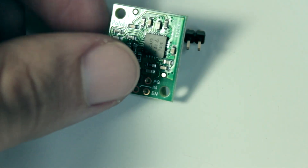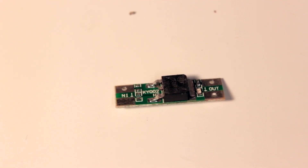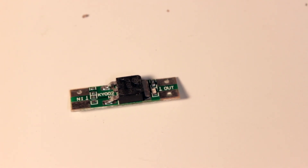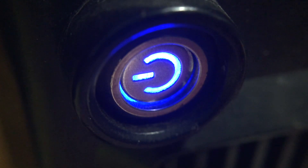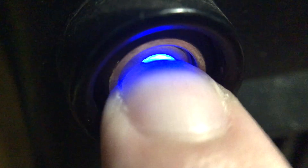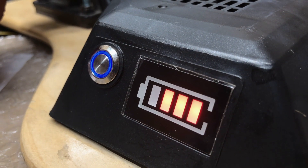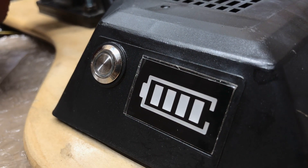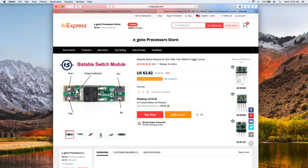The problem is I needed a way to turn it off and on at the same time as the battery indicator, which brings me to my third component: a generic soft latching power switch. Power switches come in several different types. My Firefly uses a slide switch — pushed one way on, the other off. Another type is like the power button on my Echo: you push it down and it latches to turn on, press it again and it pops up to turn off. That's a latching power button. However, I was looking for something like what's on my Meepo V1 — a single push button that toggles power on and off with a momentary switch. That's what's known as a soft latching switch. Pololu has a few of those available, but none of them can take the voltage from a fully charged battery at 42 volts. So I had to go with a generic one supposedly rated for between 20 and 100 volts at 1.6 amps. I'm not going to test that maxed out claim though — just hoping for the best at 42 volts.